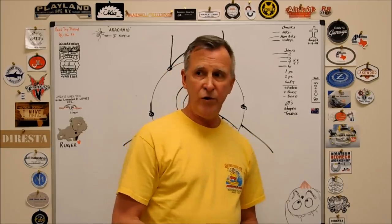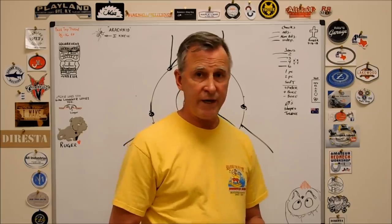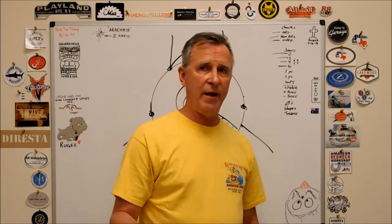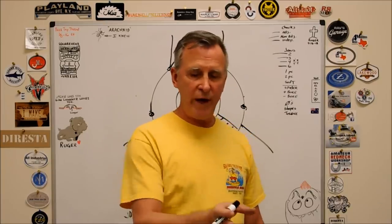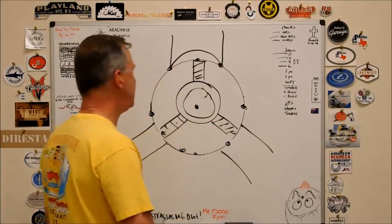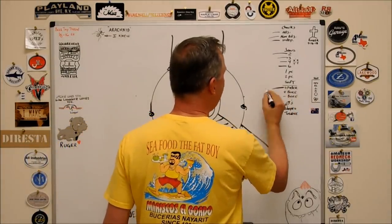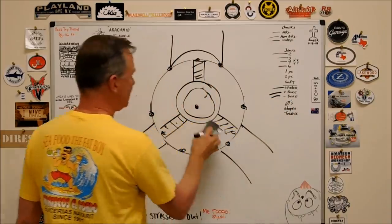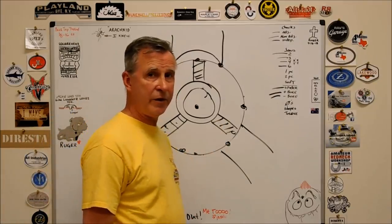By all means, once you've established a soft jaw pocket in a three jaw chuck, four, six, whatever, check the first part. Dial it in if you can dial it in. If it looks like it's running out, rotate it, check it again. All right, so we got the spider, plus and minus on the bore. I'll show you my spiders. I've got two. I've only used two in the last 40 years and never let me down.